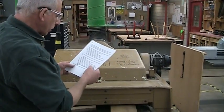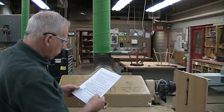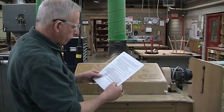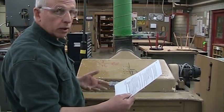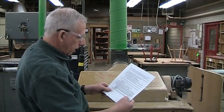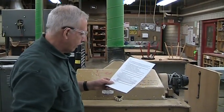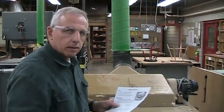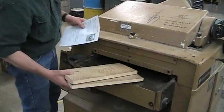A quick review of the key safety points: if the board stops feeding, try pushing it; if not sticking out of the machine, use another piece of wood to push it through. If pushing doesn't work, turn off the machine and wait for the cutter head to completely stop spinning before lowering the table. Do not lower the table or look into the machine while the cutter head is still spinning — that's written in bold on the handout. Disconnect the machine from the power source before making repairs or touching internal parts. Not a tough machine overall, but watch out for that crush hazard.